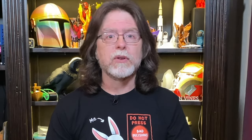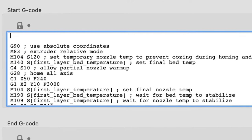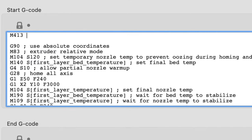And it turns out this is astonishingly easy to do simply by inserting a G-code command in your starting G-code. So that's what we're going to do. Let's get into PrusaSlicer, and then in the printer settings for the printer, we'll look in the custom G-code category. Here in the starting G-code field, right at the beginning of it, I'll type M413 S0.